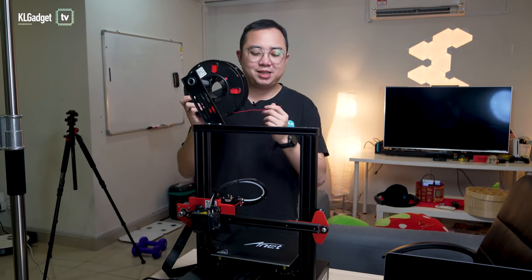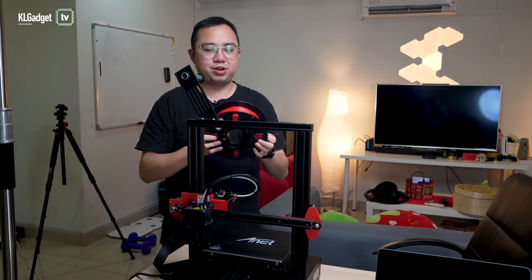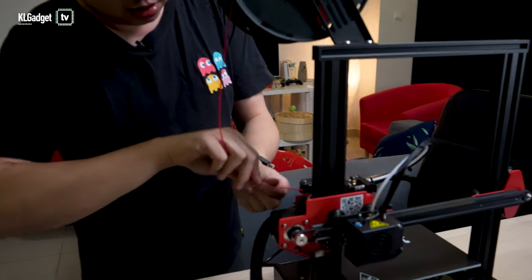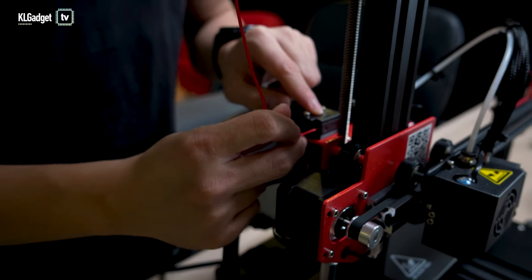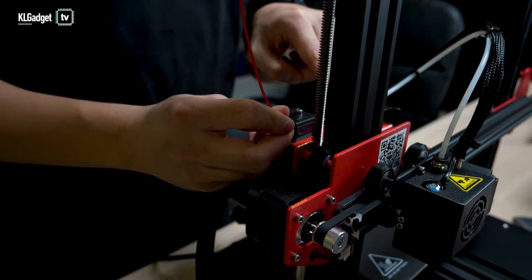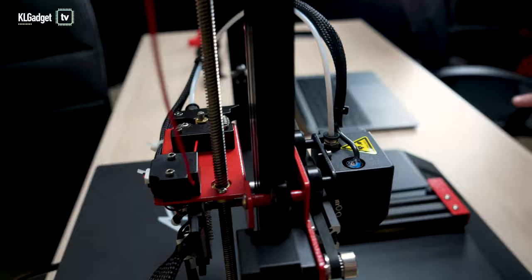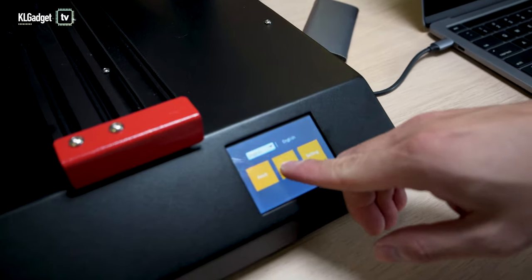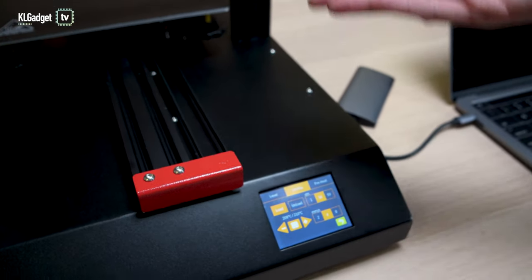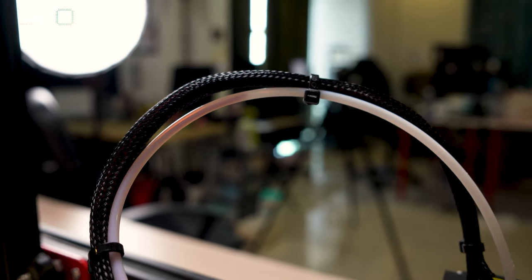Before printing the simple chest, I've unloaded the red filament to show you how to load filament into the E-T4 printer, which is actually pretty straightforward. Put the filament on the holder, and insert the end into the hole here. There is a directional arrow showing how to insert the filament, so make sure you align the holes properly and ensure the red filament hits the edge of the golden gear. Once done, leave it and come over to the front of the printer. On the screen, tap on the prepare button, go to the filament tab, tap on load, and wait as the gear moves and pushes the filament into the tube and onto the nozzle.